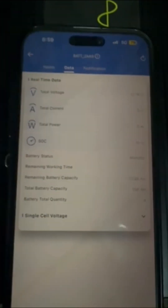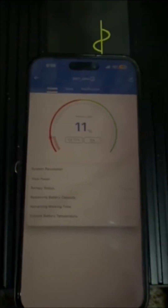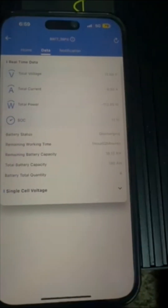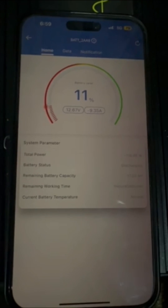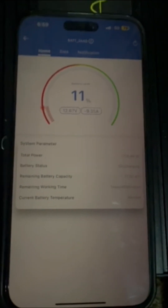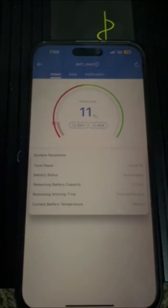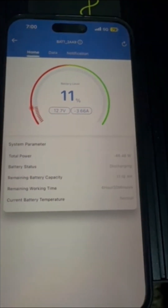Checking the other battery — it's showing 16 amp hours left, discharging at 110 watts. Both batteries are discharging at the same rate; one just has one amp hour more than the other. So that's the test — it ran my residential fridge and deep freezer for about 25 hours. I think it could actually run maybe another three to four hours. Pretty happy with that result.